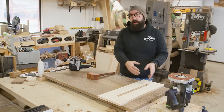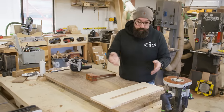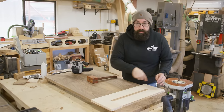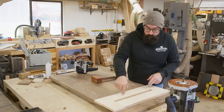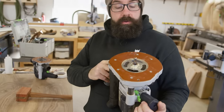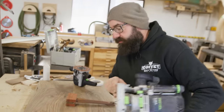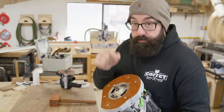Let's talk about this template and how I made it. I literally referenced the tenon to make the template for the mortise — all I did was put straight pieces of plywood up against it, built it in sequence around it, and used CA glue to hold it together. This is now a perfect rectangle, square shape around the tenon, so I can use this router with a bushing on it, which will allow me to not go outside of the actual mortise template, and cut out the material with this half-inch bit.